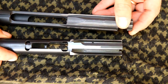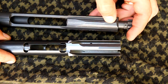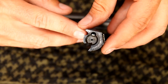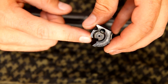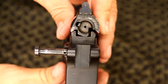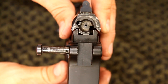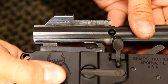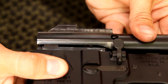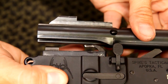You'll also notice the grooves on this .223 carrier are much smaller than on the 9mm, especially on this side. The 9mm grooves are actually milled larger so that they'll fit with the feed ramps on the 9mm ARs, as well as the ejector, which is not a part of the bolt like it is with the .223 or most others.